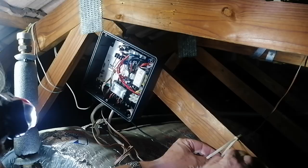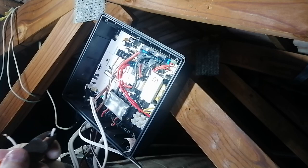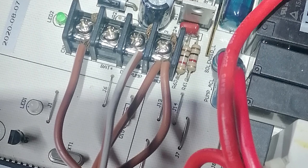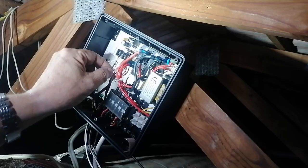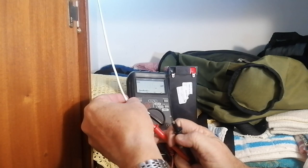As I said before, the battery negative connects with the others to ground or GND, and the battery positive — the one with the knot in it — to BAT+ or battery plus. I double-checked that connections are all good before connecting up the battery. I also double-checked the polarity and wanted to see the no-load voltage, which is quite high — 15 volts — so I hope it does not overcharge the battery.